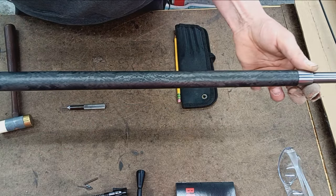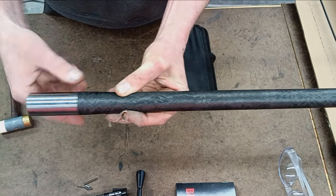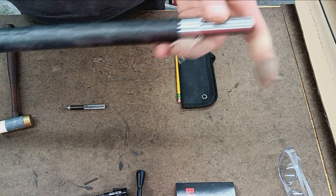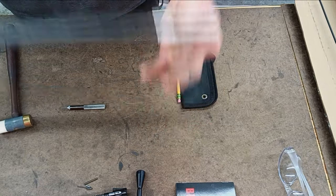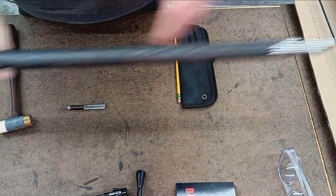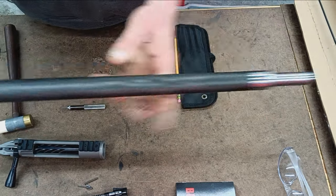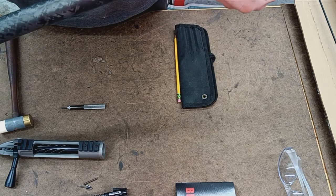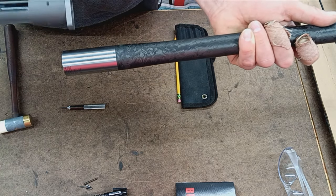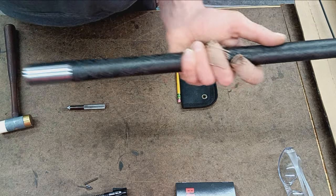The other benefit of that is once you have this aligned in the front, using a long reach indicator and two points of dialing in, the back end of the barrel is going to be swinging cattywampus, undoubtedly, because there's always some curvature to that bore. So the benefit of that technique is you can align. Once you get that receiver torqued, basically you figure out your high spot. Where the barrel is pointing up, you would mark a T for top. Then as you machine that tenon, you would machine it so the action torques onto the shoulder at that high spot.